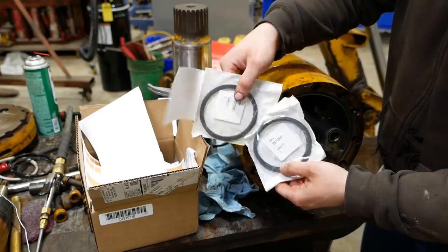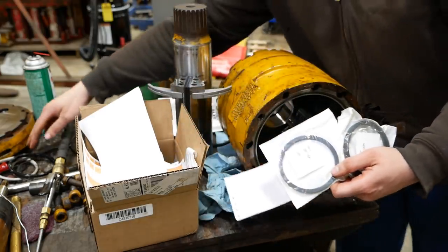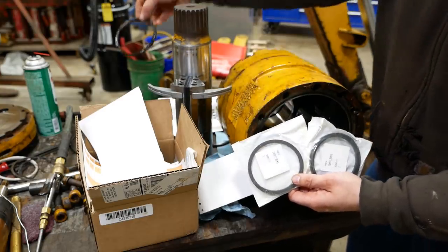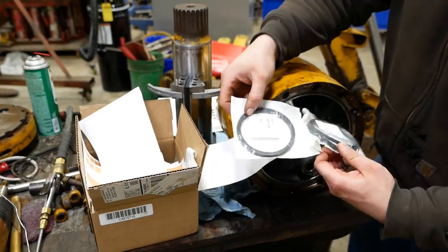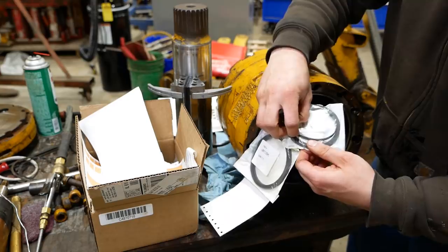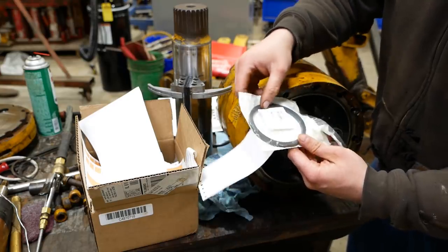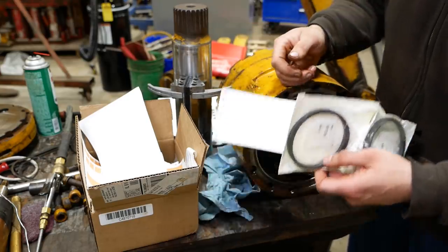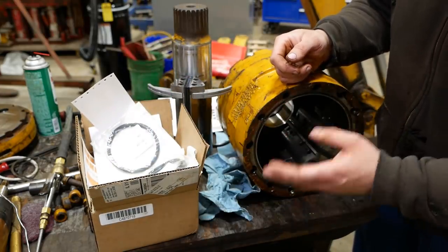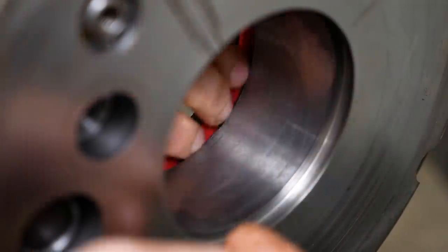Anyway, there's the seals, the main important seals. So it's a little bit different design. Before it had this quad ring, and that's going to be replaced by a two-piece seal. So it's got kind of a wear band and then a softer seal like this. So I don't know if it's better or worse or what it is. It's just different. Anyway, everything's, well, except for the drum, everything's cleaned up. Let's start putting it back together. Okay, start with our priceless backup ring. $126.